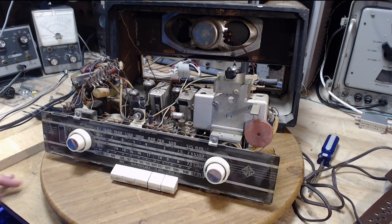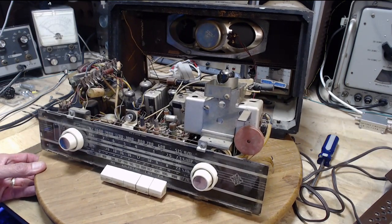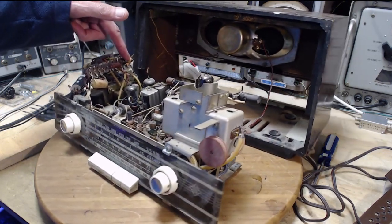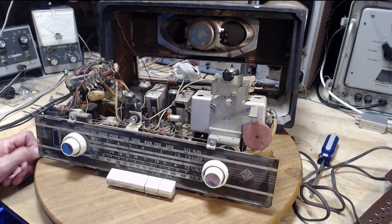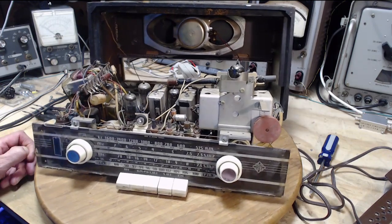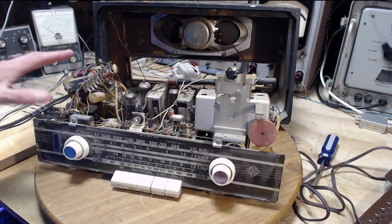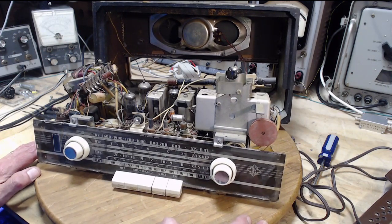Fantastic. What am I doing in my shop here? So what I'm going to do today is try to eliminate all this type of capacitor here. You can see up here is one here. I've looked them over. It looks like most of them are in the audio circuits of the radio too. So I think what I'll try to do is concentrate on replacing what I think are audio-oriented dilapidated capacitors. I'll finish that phase of it. Play the radio. I'm quite interested in how the FM will sound at that point.